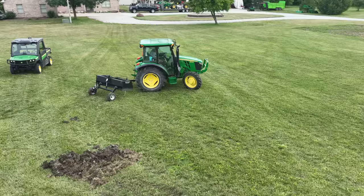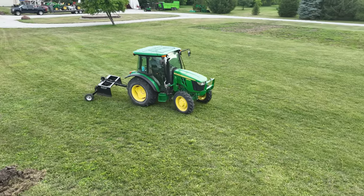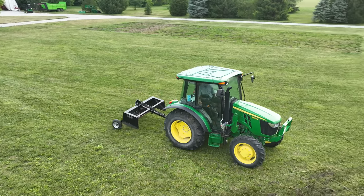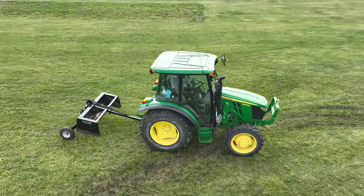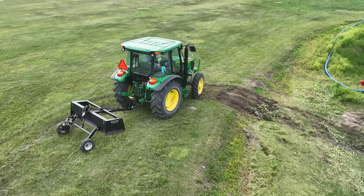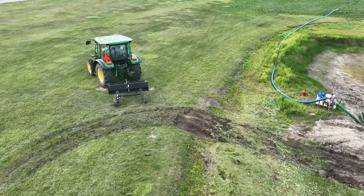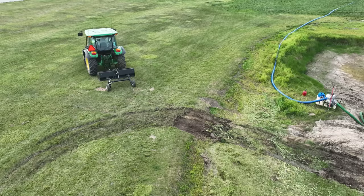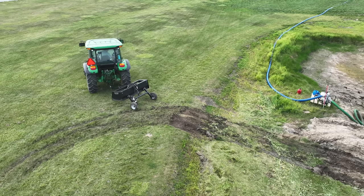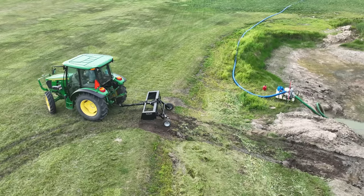So that's a range. Have to stop to shift into B range. I got a lot of people complaining about my analysis of shift on the go. I consider shift on the go to be what I can do under power, under load, I should say, without a clutch. And I just don't see the synchronized transmission as being that. Now, I did fail to mention that the transmission was synchronized, and that's not fair. So it is synchronized, the 1 through 4 gears in each range are synchronized.